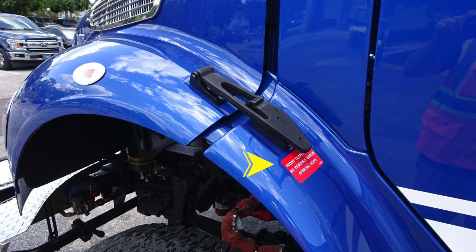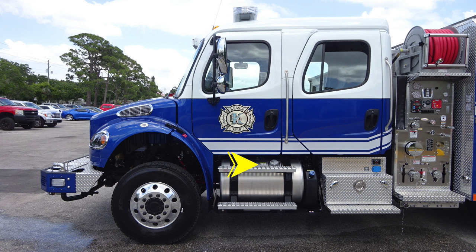on the passenger and driver's side, and also an indicator to remove the front bumper turret. As we move down to the driver's side of the vehicle, you'll find the silver ultra-low sulfur diesel fill location. Right next to it, you'll find the blue DEF fill location. Moving further back, you'll find your auto eject shoreline inlet and also an indicator regarding the charge status.